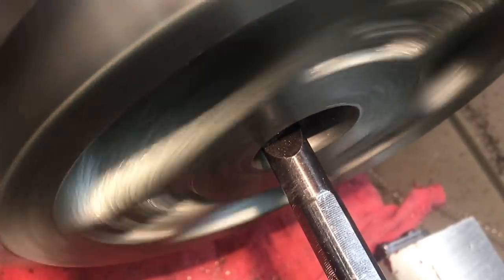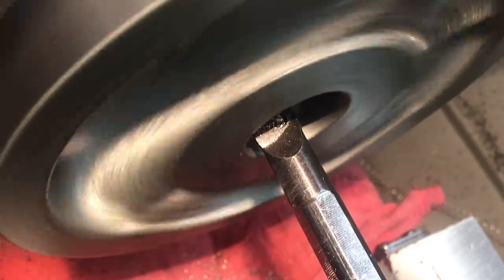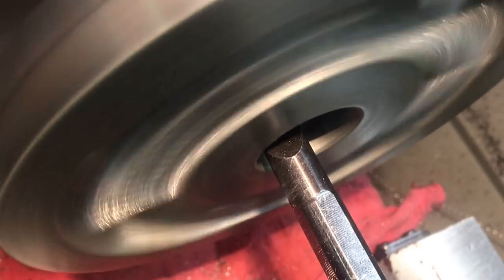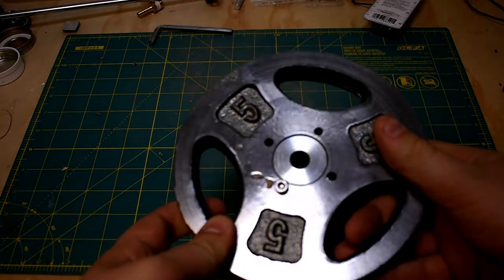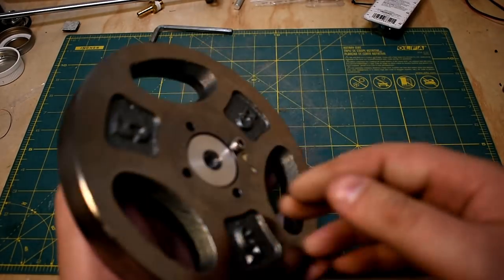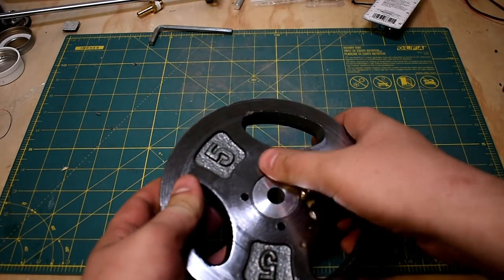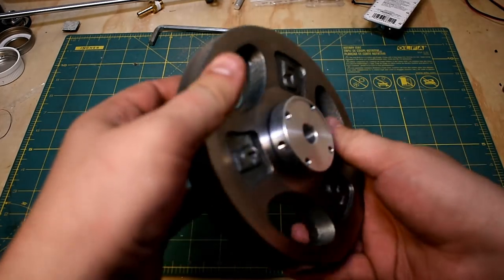Because I was gripping the outside of the part this time, I felt a little more comfortable turning the speed up to 250 or 300 RPM, just so I could get through the boring a little faster. The bore ended up being far too big for what I needed, so I had to make a little sleeve. You can see that's just going to be fastened in with fasteners — I only had one of the right size — and I've got a set screw to hold it in.